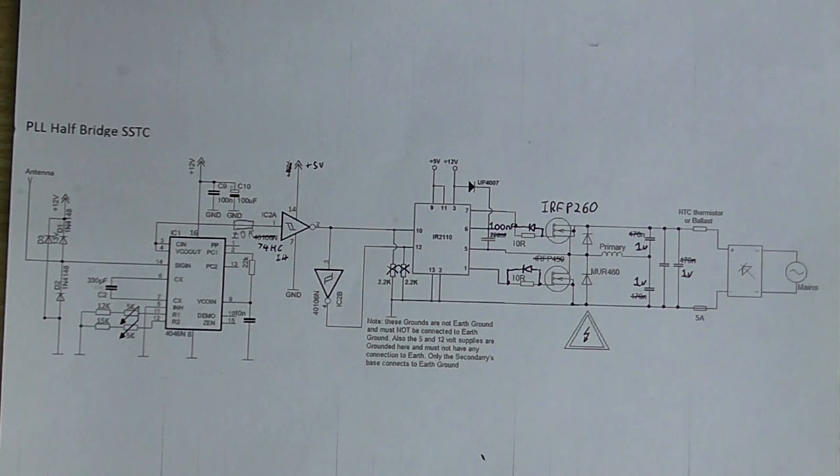Now, of course, I didn't get the full 117 volts AC into this thing, which would have been about 160, 170 volts. Round about that voltage, though. The maximum amount of DC voltage I got into this was about 117 volts, but you could see that even that was pretty impressive. Thing is, I don't dare to run this unballasted because, you know, I took a lot of time making this. And I don't want to just blow it up if something goes wrong, so ballast is there for safety reasons mainly. That way I have some control over the amount of current, because I use a room heater as my ballast, and I've got different heat settings on that so I can switch in the different elements, so I can control the amount of ballast that goes into this thing.